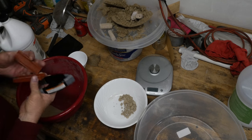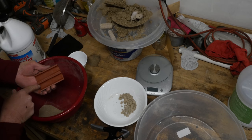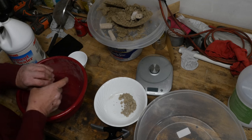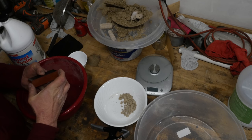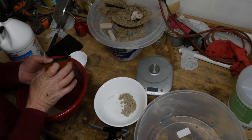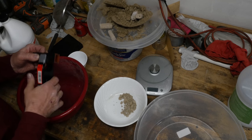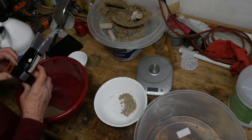I'm going to take a mold that I made — I printed this on my 3D printer. This end is wider than that end, because I want my hammer handle and the hole through the eye in my hammer to be tapered, so that when I put a wedge in there it will wedge in tight. Basically all I have to do for this pattern is just sort of hold them together, and I'm going to put these spring clamps on here just to hold it.